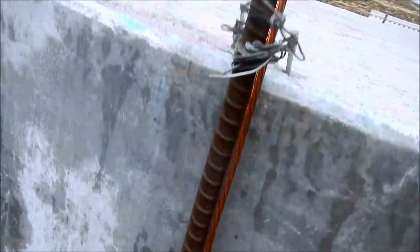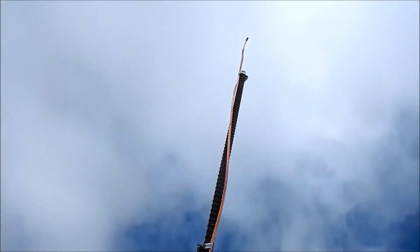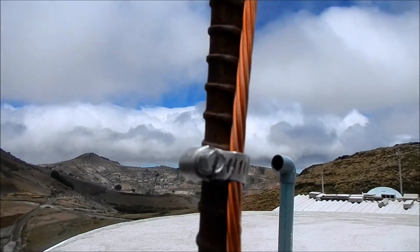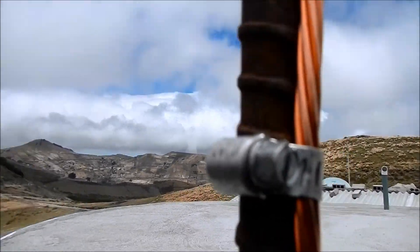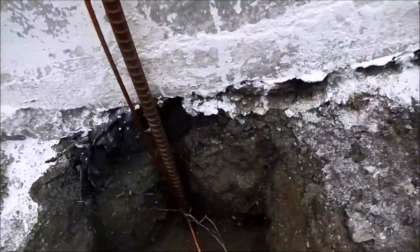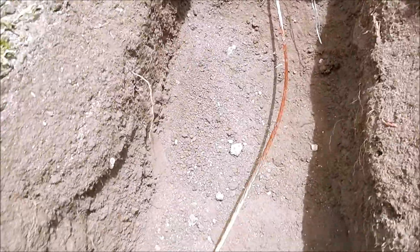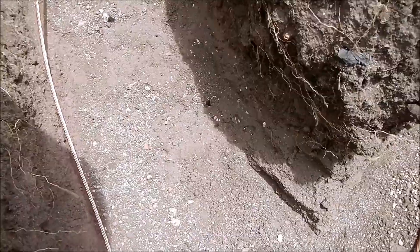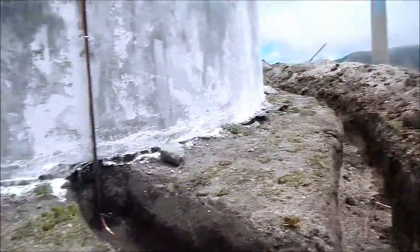I've got some wire here running along the whole ground line. Fire hose clamps are used, and the ground rod comes down into the earth. We're burying it on average between 10 to 18 inches here in the ground pit. We've done a ring that runs around the tank.